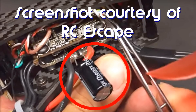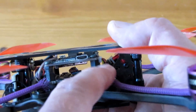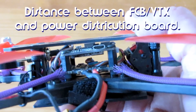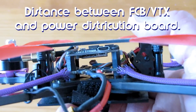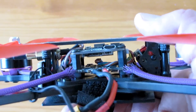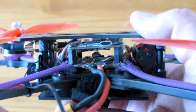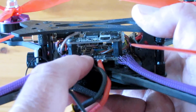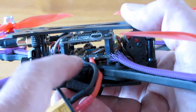The Bind and Fly version, which I got, does not include that capacitor. It does include these separators they've added to give it a little more distance between it and the power distribution board. I think their intent was to reduce video interference from the motors and ESCs, but that doesn't seem to work — it didn't do the job for my particular drone. They removed the capacitor, betting that these spacers would get rid of the interference, but it doesn't.